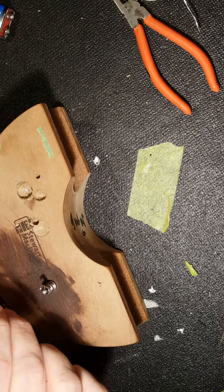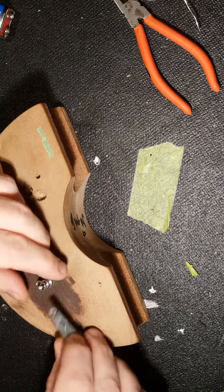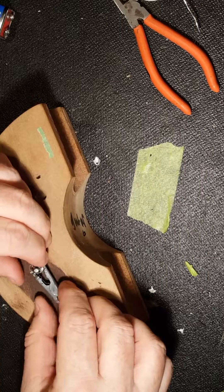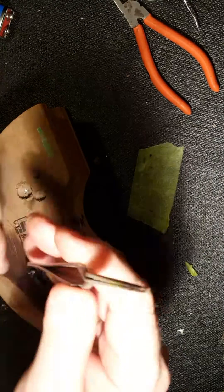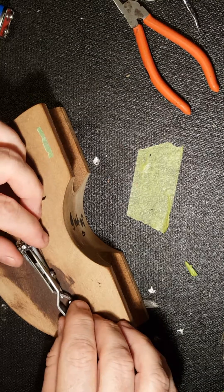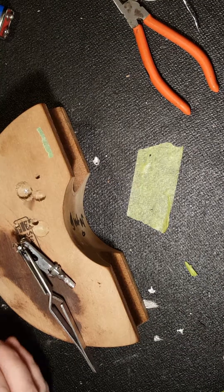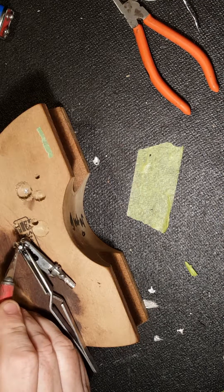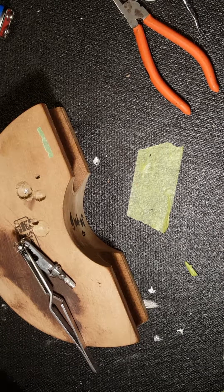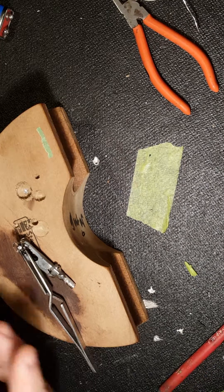We know the black wire is going to go in here. I'm going to take one of my little clips to hold it, and take these self-locking tweezers and put them on there. What that's going to do is act like a heat sink — it sucks up excessive heat. I don't want the soldering iron to heat this up and have the heat travel all the way down to melt the little plastic insulator. So the excess heat will go along here and not down there. That's the theory anyway.